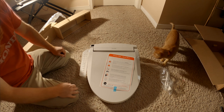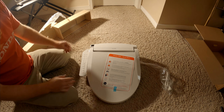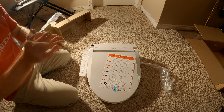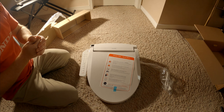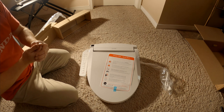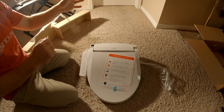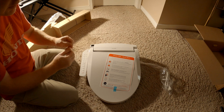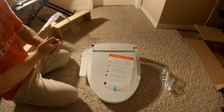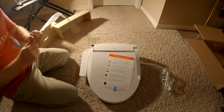I'm going to try it on one toilet. We'll probably use an extension cord before I go through and wire the house — use the extension cord for maybe a few months to six months, and then I'll wire in an outlet. We'll probably do our half bath by the entryway, because that one is the easiest to access for an outlet — the basement's right below, unfinished because of the furnace room, and there's a wire not too far away I can tie into. I'll make sure it's a GFCI grounded outlet — I think I have a box of them — and install it behind the toilet. Can't get shocked; it'll just trip. Be on the safe side and do it right.